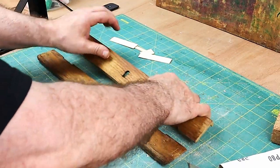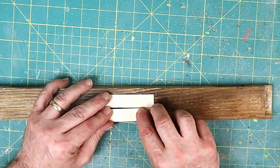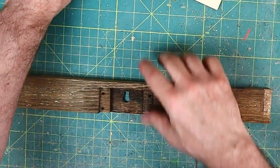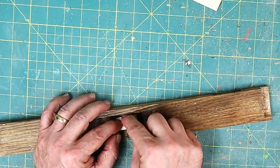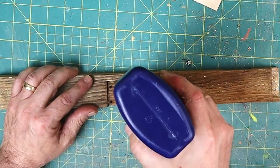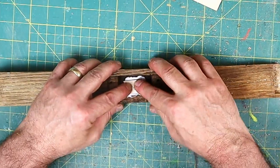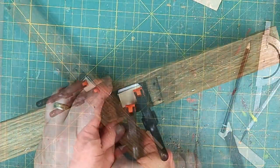These are the two strips that go at the front. I want these to be a solid front, but I don't want to have a lock in it or a big backing there. I'm just going to fill that hole - these are just lolly sticks, believe it or not. I'm going to glue those in and that will fill that hole, then I'm going to fill this hole with some filler. I need something on the back of it to stop it pushing right through, so I'm going to glue on that little bit of lolly stick as a backing.